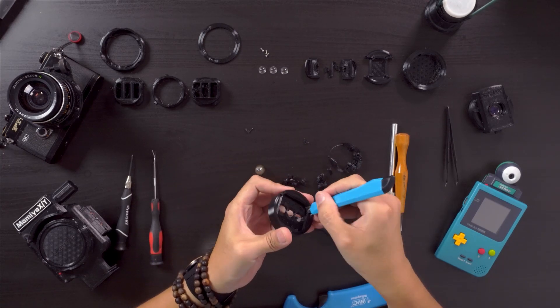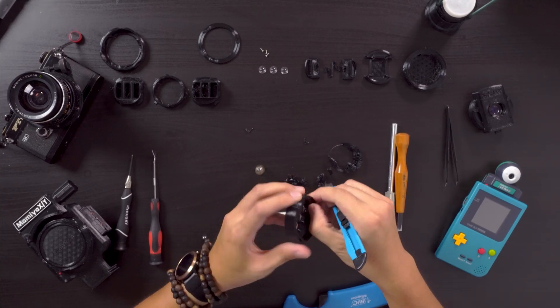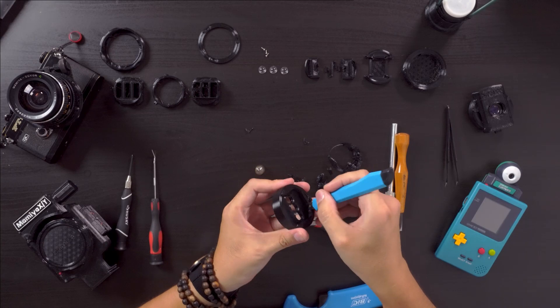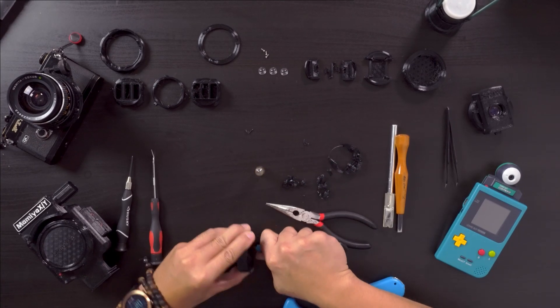Then it's over to the dull straight razor to clean up any zits or stringing in the interior so the lens baffle will fit snugly. I finish up by cleaning out the lip that the lenses will sit on with a razor and a straight chisel.